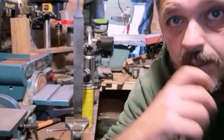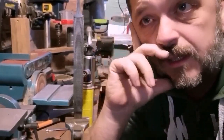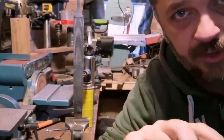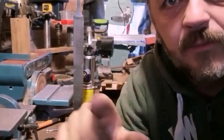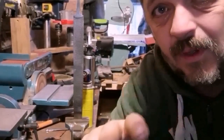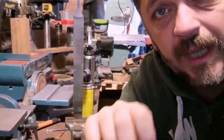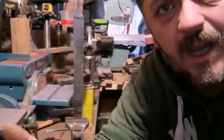Right, okay. I mean, I'm right here and I can feel the heat coming off that. As you could see, I wasn't able to get it consistently red across the file, but I know every area that I'm using was heated up to that red colour. So I'm kind of hoping that that'll be enough. And once it's cooled down, I'll be able to work on it a bit easier.